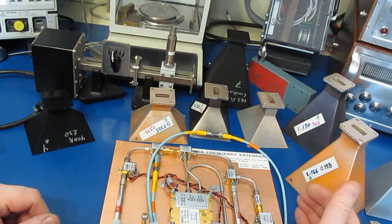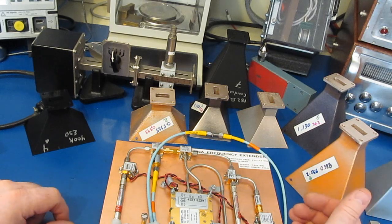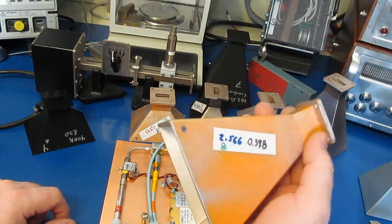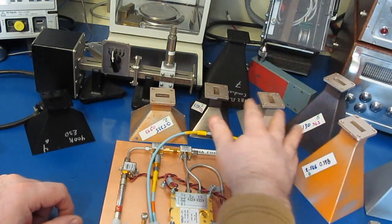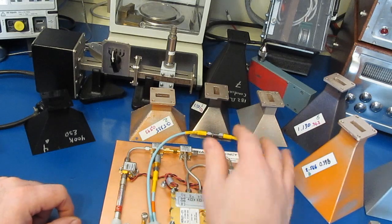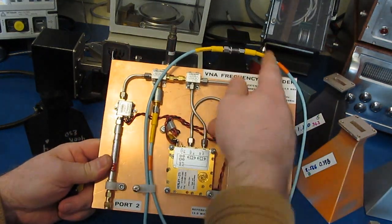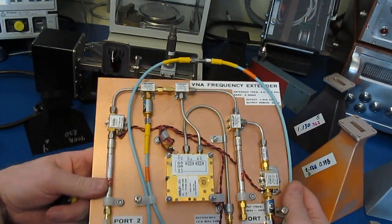And I go to run the next antenna, and basically the antenna's radiation pattern is total crap. As a matter of fact, it was the very first large horn that I was testing, and the radiation pattern wasn't anywhere near as good as what these small horns were. Of course, pull down the extender, start running tests where essentially I just short the 2 ports together, and I had no gain coming out of this.